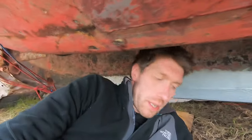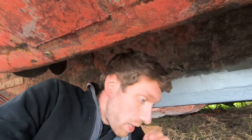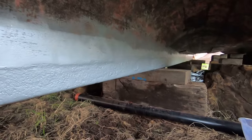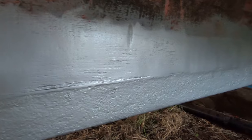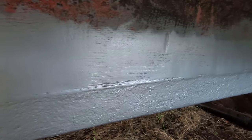I've rolled it all on, and then just in those areas where we've got the rivets and the seams and things like that, I've just used a brush to make sure I've got good coverage. But yeah, I've added one layer at a time, 40 microns at a time. That's actually not too bad, to be fair. So this final coat that I've managed to get in today is just going to dry off now, and then I should be able to come back to it